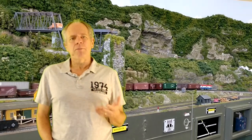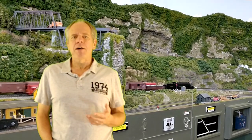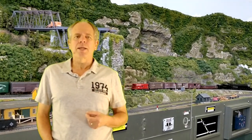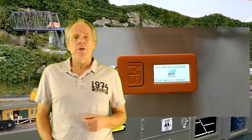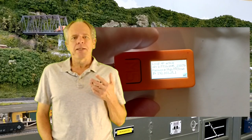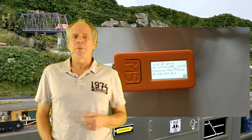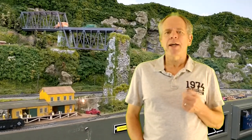Wi-Fi will also not time out if it is used for normal operation, for example when receiving commands over MQTT or when acting as a gateway. In these cases the Wi-Fi connection remains active even when no browser is connected. If the Wi-Fi connection does shut down, the status is shown on the display. Clicking the B button will cause the IoT T-Stick to either reconnect to your Wi-Fi or restart its own access point, depending on the previously active Wi-Fi mode.